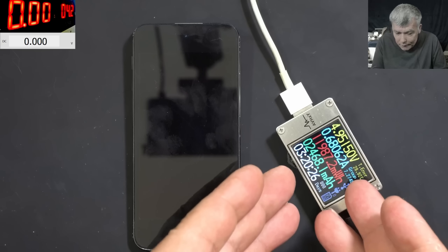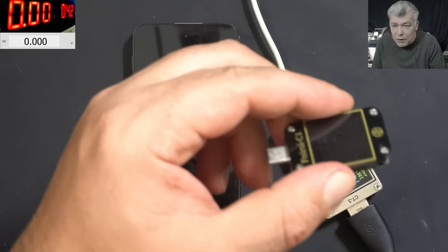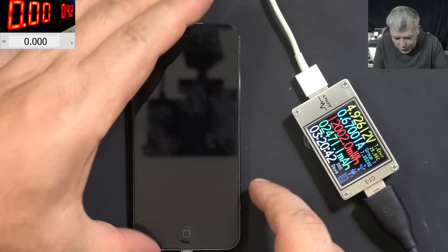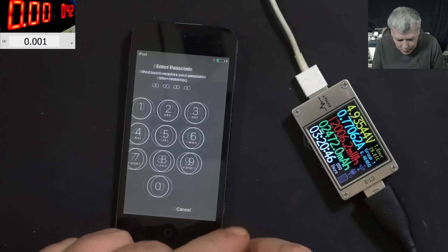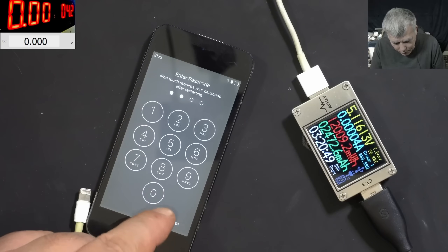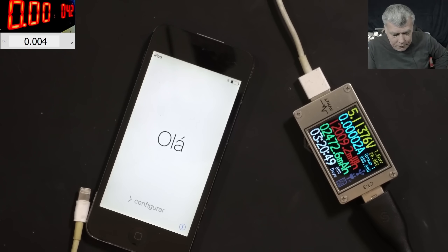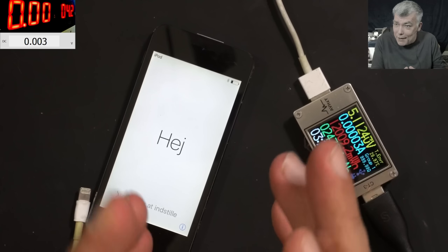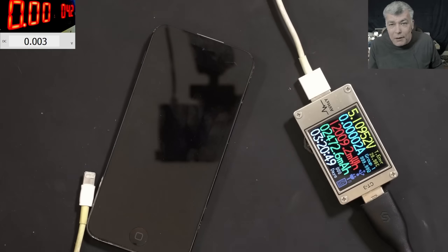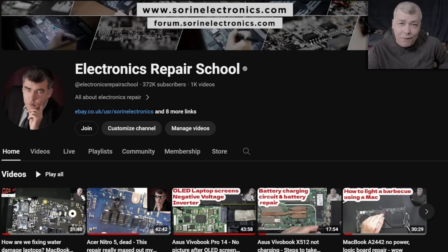I hate power meters — they try to save energy by turning the backlight low or off, which is not ideal for a tool. The iPod is taking 0.6 to 0.7 amps with a green battery indicator. Unplugging the charger, you can see the iPod is on and the touch screen is working — everything is fine. I'm happy I could help the customer recover their data. If you have a job that looks very bad — like jumping current — it can actually be very simple like this one. Thanks for watching, like and subscribe, see you on the next one.